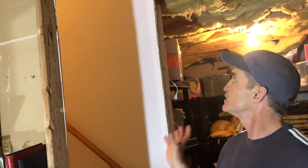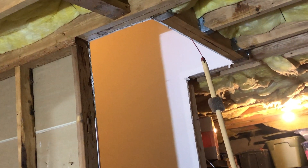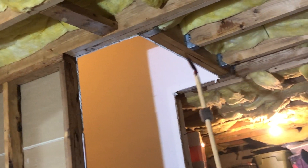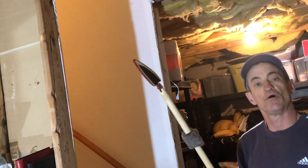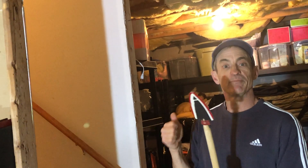If you guys have time, go down in your basement, take a look, and see if you can identify some of the parts down there. Typically a stairwell opening like this — I have an L-shaped stairwell opening, a little different than the ones we built in class on our little floor frames. This is just one side of our stairwell opening, and we talked about the nailing pattern — how we had to nail this one in first so we got good nailers into our cripple joist. We put this one on first, then added the second one, and went through that whole nailing process.